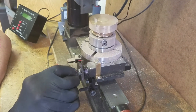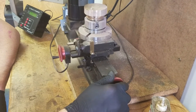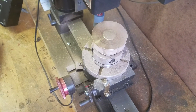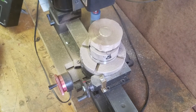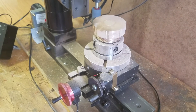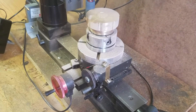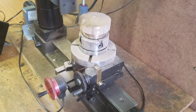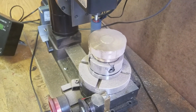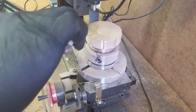What you're watching here is the use of that rotary table to put in finger grips. We studied at some length the photographs from the factory, which are generally side-on, and this allowed us to actually scale using the tire size via the photographs — which then allowed us to measure the radiator cap, figure out its exact size and height, and also figure out that it had exactly eight grips, or in other words, one finger grip every 45 degrees. With the rotary table, we rotate around each 45 degrees. We used the y-axis to feed in slowly, with the DRO telling us our depth, and we're using a grinding stone to cut the finger grips. This was chosen so there couldn't be any possibility of chatter, since we are working with an almost finished part.